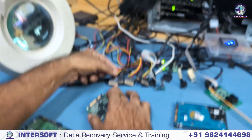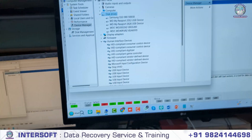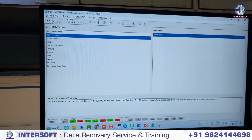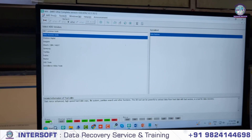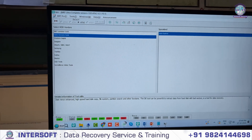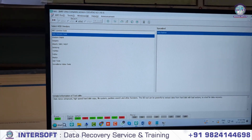We connect to MRT on port 2. Going into MRT SATA port 2, the power is off initially. When we power on, the power is on but it is not busy, which means there may be a SATA problem or a firmware issue. So the SSD is not powering on properly — we have to find out what the problem is.